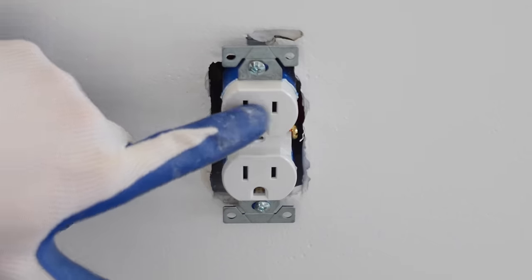When I rough wired this, I put a piece of casing on that labeled where what was going. So this says cabinet, so I know that is heading up for the under cabinet lighting. So that's one leg to it. And then we got our white, which is going to be for our receptacle. And then we got a ground, which is going to be for a receptacle. And then we got the power coming in here for the switch, and a power coming over here for the receptacle. So right here is the way it's going to be separated. And now I just got to make my connections.